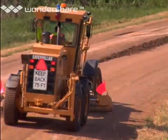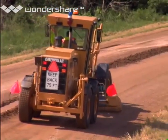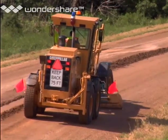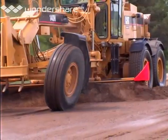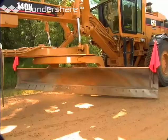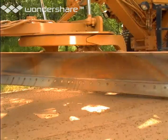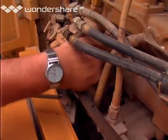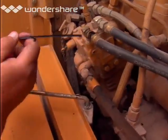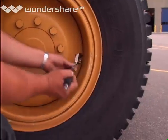The biggest job you will have to do with your motor grader is reshaping the roadway in the spring. Spring is generally the best time because you have less vegetation on the shoulder to deal with, and there is generally more moisture in the gravel, which makes it easier to work and it will be dust free. To effectively blend the gravel and reshape the roadway, your motor grader's moldboard has to be in good condition. If the cutting edge is worn in the middle, which happens naturally from use, you'll never be able to shape the roadway correctly. So be sure to check the moldboard before you leave the shop, and also do a thorough service inspection including checking the tire pressure.